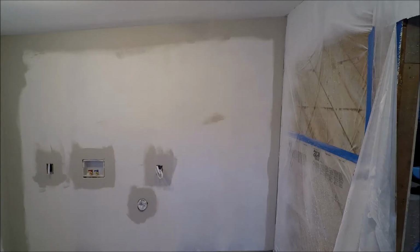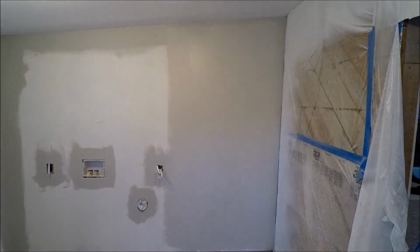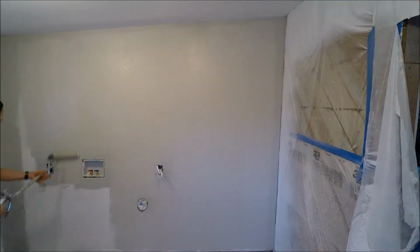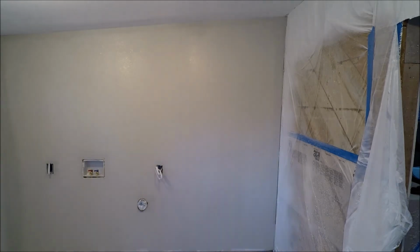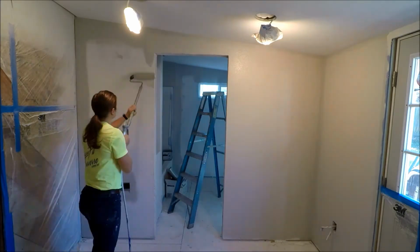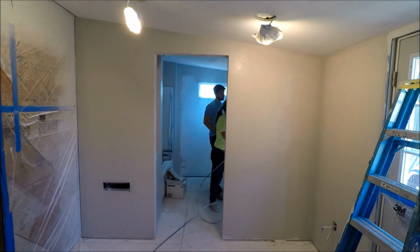And then starts the new tool. Your Graco pressure roller. Oh, it looks so pretty. Which hooks up to our airless paint sprayer. So it gives a continuous, perfect quantity of paint on your roller at all times. I mean, this is our first time using it, and it beats out using a roller and a pan of paint. Oh, for sure. It was really handy. The amount of mess was really like next to none.